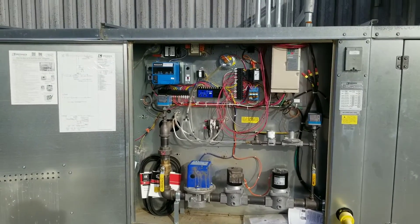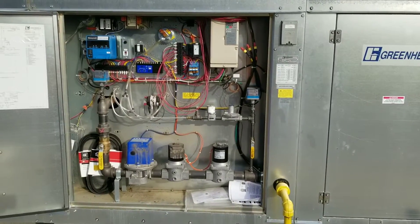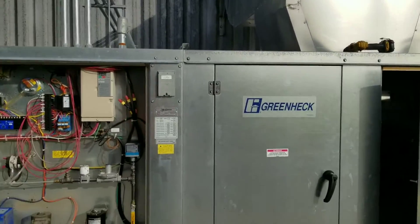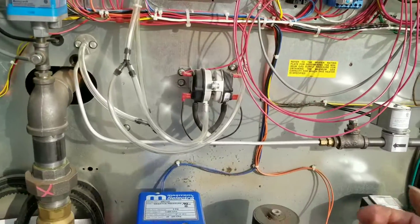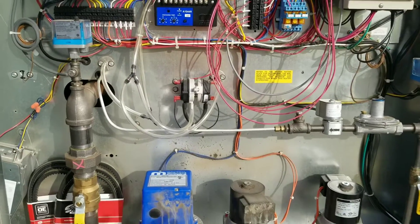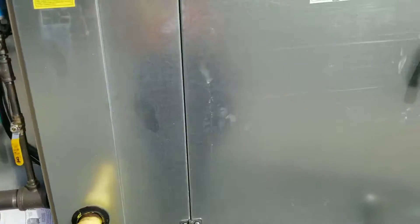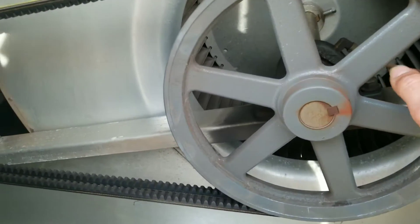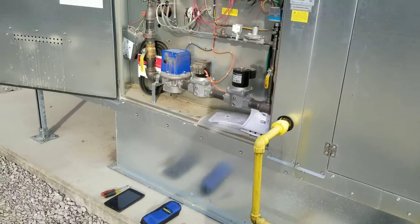Just want to let y'all know — it's the little things, man. Sometimes you check everything out and it just doesn't quite look right. 90% of what we do is air flow. Pressure drop across my burner: the book said 0.5, but Greenheck says they recommend 0.65 to 0.8 — we're right in that 0.65 range. If I need to adjust the speed on the pulleys, we can. Greased my bearings, belts are good and tight. This one's good to go — we'll see y'all next time.